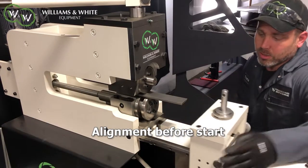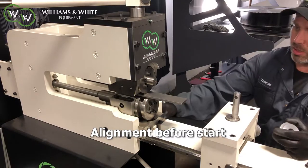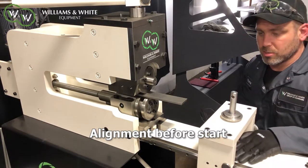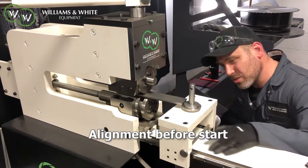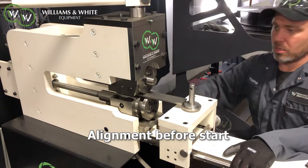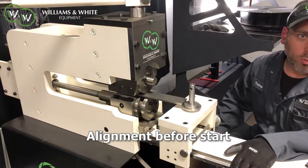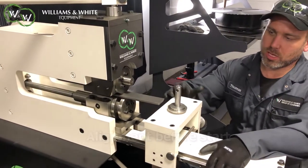We're checking here, putting in spacers. We've got our eccentric spinning so that it's nicely centered, but the spacer made by our machine shop is a good eighth of an inch lower than where the saw will be sitting. So the saw would be sitting on an angle, and that's something you don't really want.